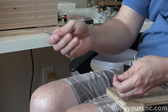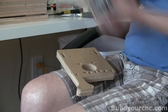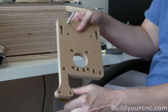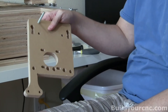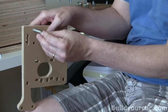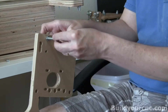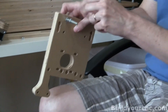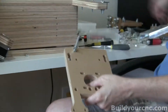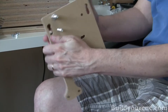We'll start off with a three inch screw. Note the orientation — the protruding portion is to the left. You've started the screw, and we're going to use three nuts in all, with two nuts added as a spacer. You don't want to tighten it down completely yet because you still want a little bit of movement to make sure we can get that mount on. We'll take another three inch screw and put it in this hole.